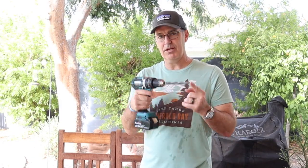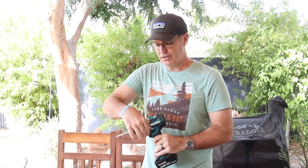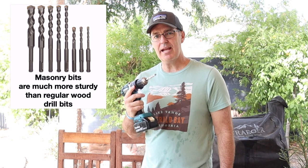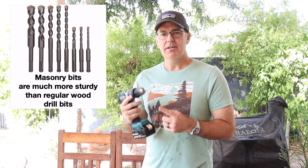What you're going to see me do today is use a regular drill with my drill driver to drill through the drywall and the wood. Then I'll change out to a concrete drill bit — those are pretty cheap, links are down in the description — and switch to the hammer drill function to go through the concrete. Do you need a hammer drill? Not in this case. You can always just get a concrete drill bit. If you have a regular drill, it's just going to take a little bit longer, but you can make it happen.